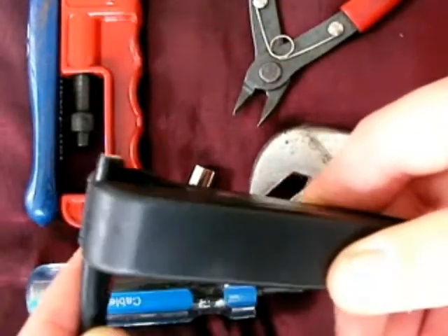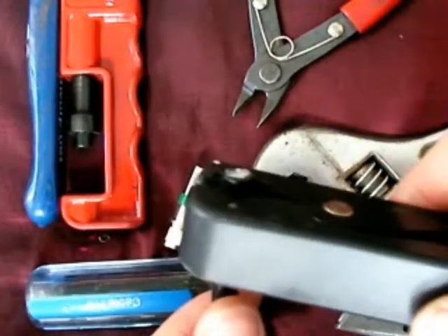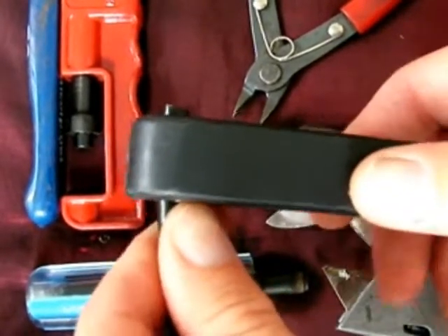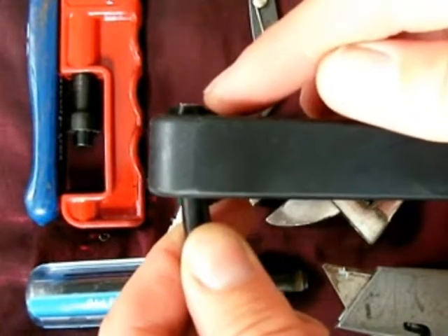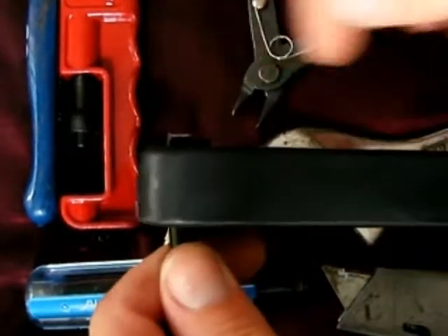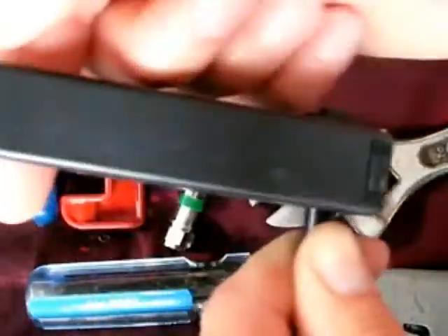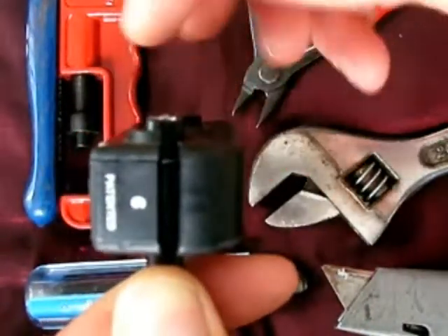What you do is you put the cable inside the stripping tool, and you let just maybe about two millimeters of the cable peep out. Once you get it in there, you lock it in, just squeeze gently down, and you twist it around three or four times — this really comes with experience. You can hear that little sound; that's the actual blade cutting the strands.